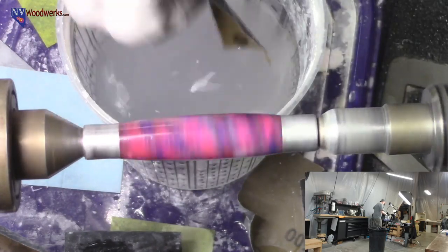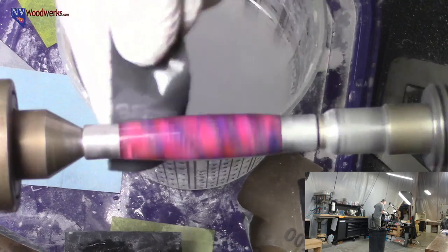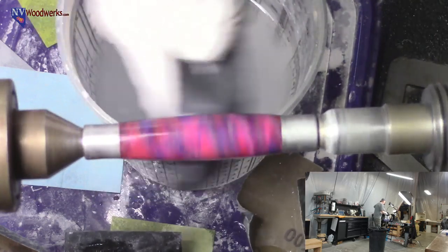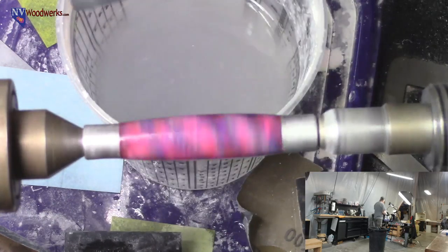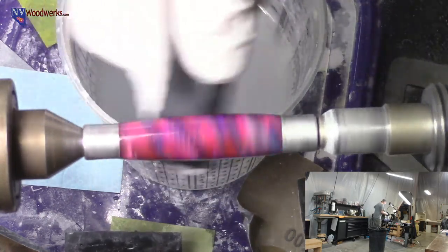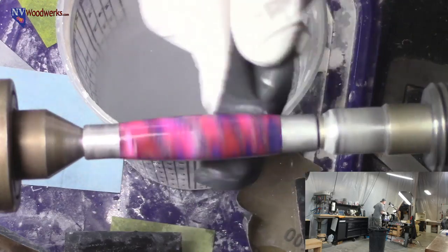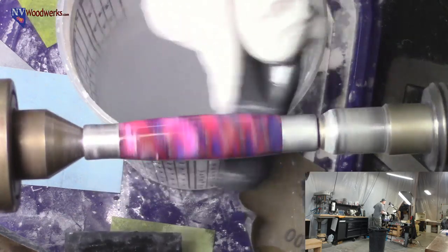Depending on the types of materials that you're turning, if you stay away from super abrasive materials, those carbide cutters should last. Like with wood, man, those things will last forever. For some of the materials that I turn, heat is going to screw up your edges. If you're going really hard on bigger resin blanks, you'll go through those cutters pretty quick, and I tend to do that. If I was a little bit slower at turning and took less aggressive cuts, I think I'd be able to extend the life of them a little bit more.